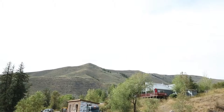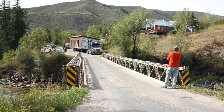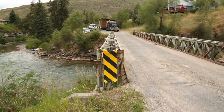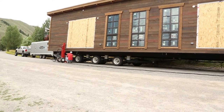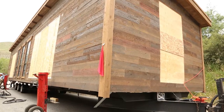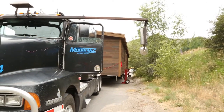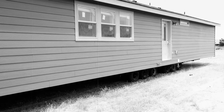We run into situations where we have bridges with higher railings, obstructions where the house is wider. So we've developed a spacer system that actually lifts the frame and chassis of the house higher than the objects we're trying to go across, while the tires and wheels stay on the ground. If we try to do that with traditional mobile home axles, it's impossible to do.